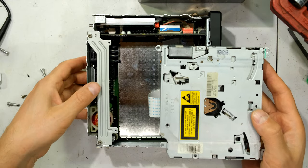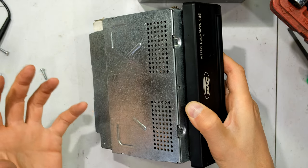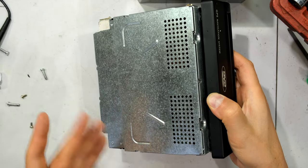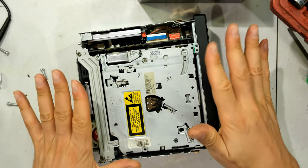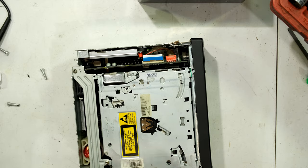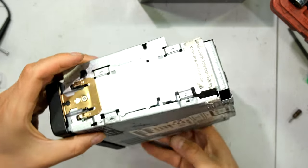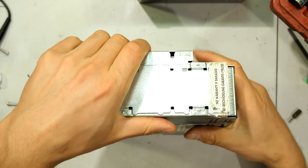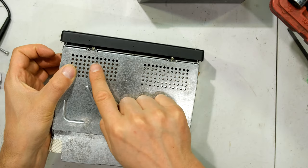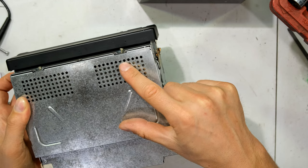If you have some oil you can clean it in the same way as I showed with the SVS module. If you want to go deeper, remove those two screws — this comes out giving you a full view of the input stage — and at the back there is a plate with two screws that also comes out, giving you an under-view of the circuit board, though it is covered with another metal box inside. In my opinion this is all working — I have tested it. To close up I come at an angle, make sure it climbs over and under those lips, align the other side the same way, then press it down evenly and seat the two bottom screws.